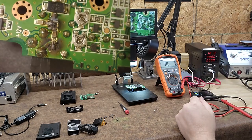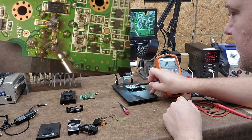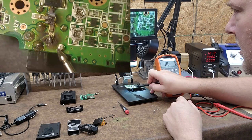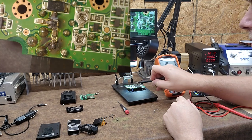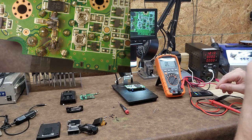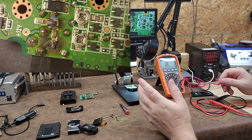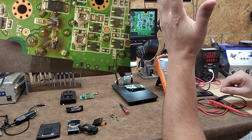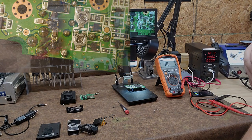Both components are a little charcoal and it won't power up because there's a short. My theory is that we go ahead and remove those components. I believe this component is probably a diode, and if it's a shorted diode we should be able to remove it because I won't need it — but we'll find out. Maybe it's going to be a total loss, hopefully not.